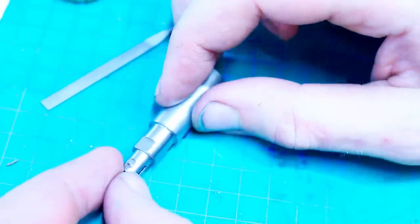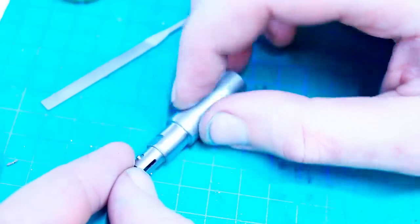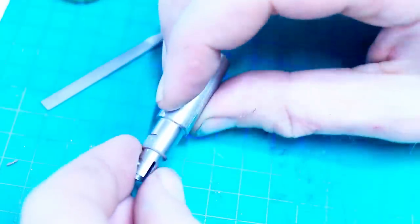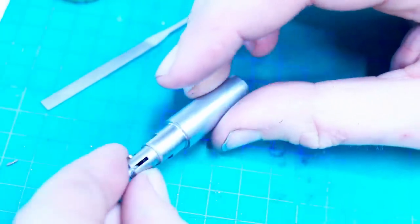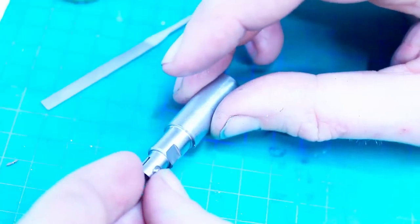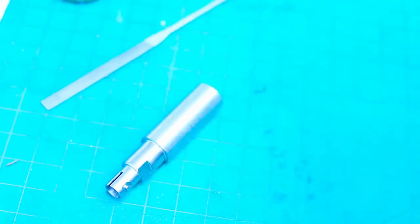So that's the blend with the Scotch-Brite wheel after stoning and some polishing. So that's what I put into a part to make it a high quality looking product. Could have left the cusping from the ball end mill, but I didn't want to. I wanted to have it look like an industrial item.